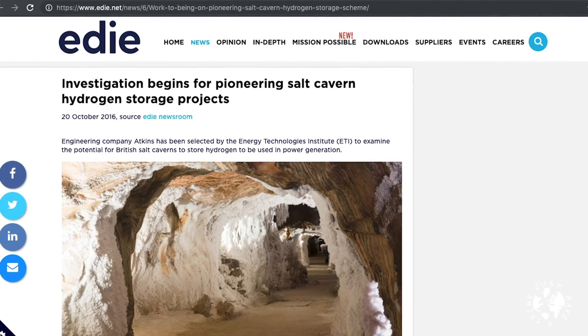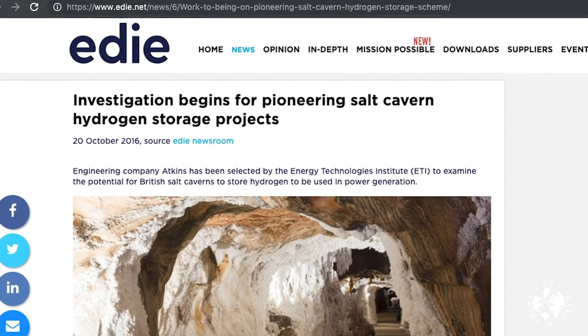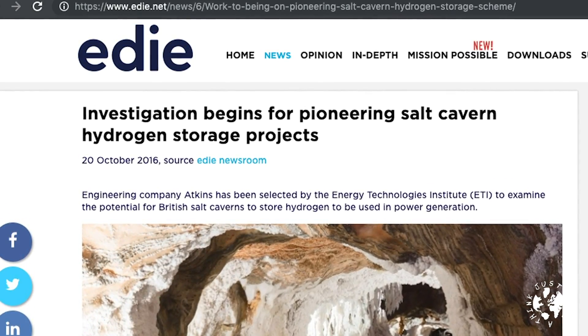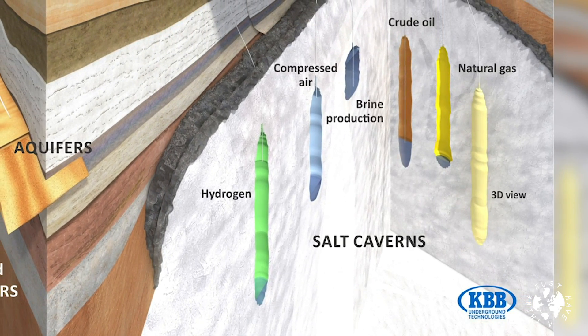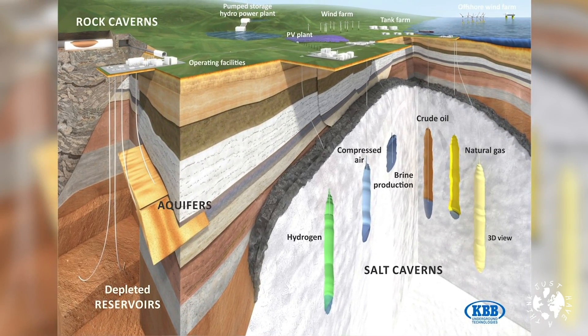In 2016, the Energy Technologies Institute in the UK started a trial using salt caverns at three locations in the north of the country. Salt caverns have been used for many years to store various types of gases for the chemical industry — like methane and chlorine — so using them to store hydrogen seems like quite a smart move. Some of these caverns are extremely deep, perhaps as tall as the Eiffel Tower, and in some cases exceeding a million cubic meters in volume. Hydrogen gas gets pumped in at high pressure, and when extra electricity needs to be generated for the grid, the gas is allowed to flow out over a turbine. It can also be fed into existing gas pipelines for domestic heating without any alteration to the system, making it a viable substitute to facilitate the phase-out of natural methane gas heating for homes.